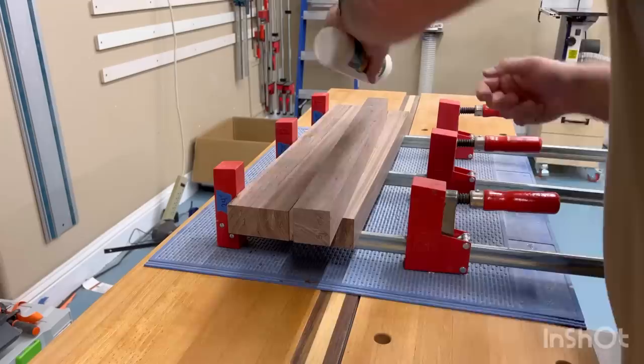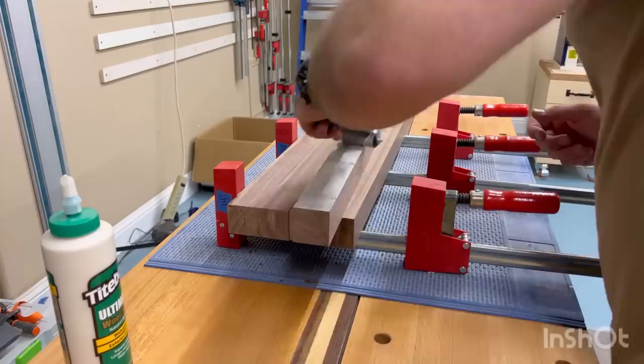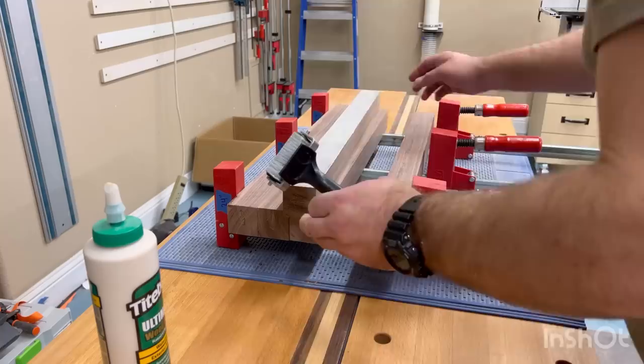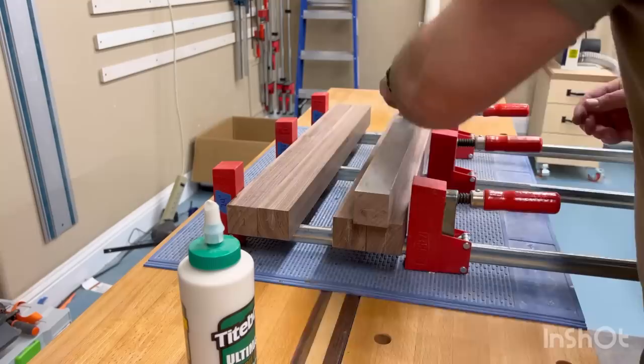I had two different options here. First, I could take all 13 strips and glue them up at once. This initially seems like it would take less time, but I knew it would take way more time on the back end after the glue up to smooth out the whole board. My planer can only accommodate boards up to 12.5 inches wide, and this cutting board will ultimately end up being 20 inches wide, so it would be too wide for the planer, and I ignored this option.